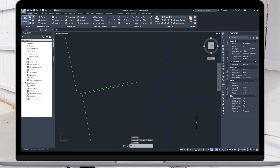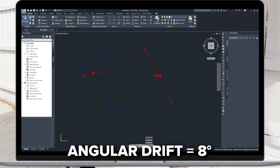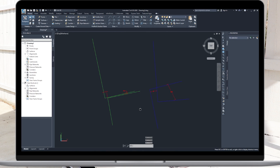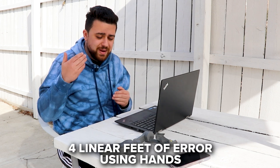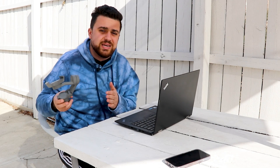Starting with the hand scan in blue: the error in distance between the fences is 4.08 feet, and the angular drift is 8 degrees. Now for the gimbal scan in green: the fence distance error is only 0.21 feet and the angular drift for the building is just 2 degrees. The perimeter of the house is about 200 feet, and with all the turns and jogs we're finding about 4 linear feet of error using just my hand, versus only 0.21 feet of error using the gimbal. That means there's an incredible amount of error being introduced through the gyroscope and accelerometer when using just your hand — using a device like a gimbal to stabilize your scan gives you much better raw data inside your point cloud.